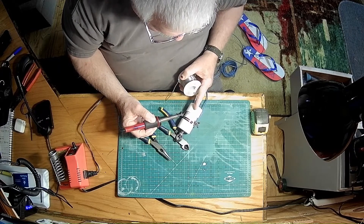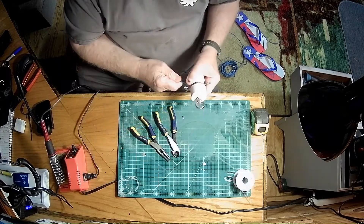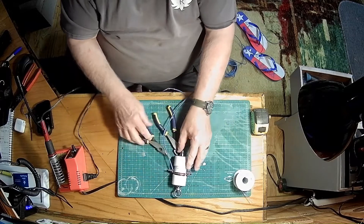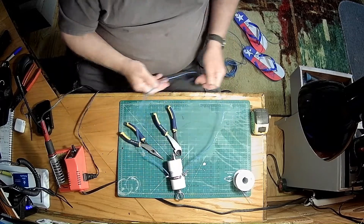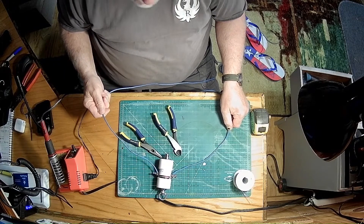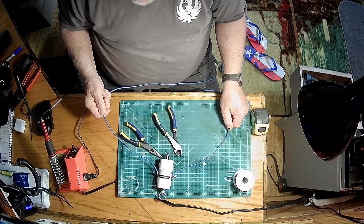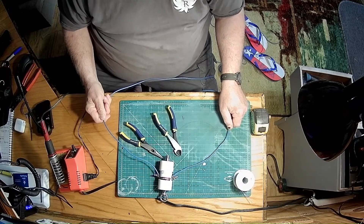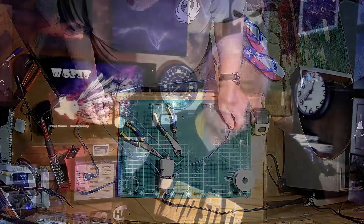Let me get that hot. Alright, here we go. There it is — 8.2 feet on either side. Wire. One 10 meter dipole or inverted V antenna. It couldn't really be much easier than that, could it? Takes maybe an hour if you're slow like me. The total money I've gotten into this thing — I paid about 30 bucks for that balun.